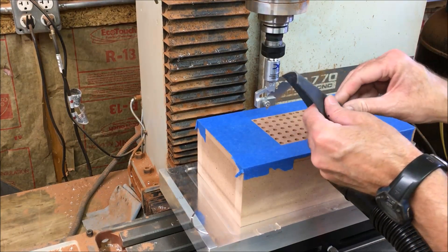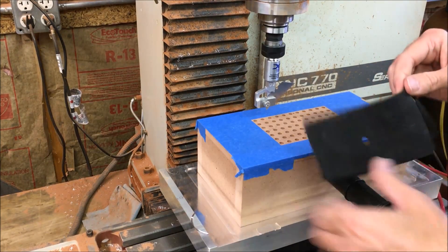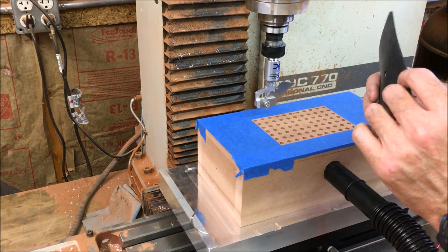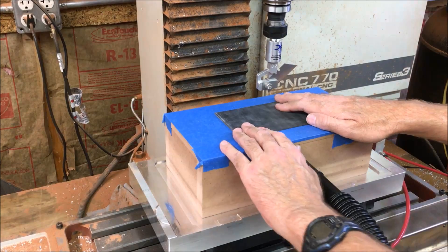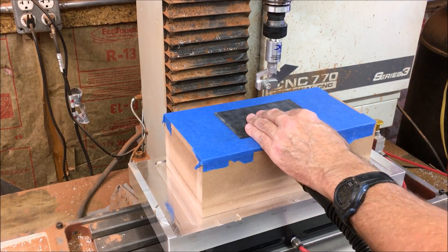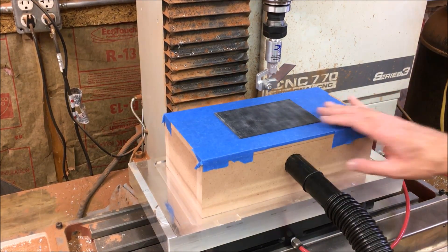The center always seems to be fine, but it still has those little things on there, and they seem to be fairly evenly spaced — I get the suspicion it has something to do with these holes right here. Multiple depth of cut didn't work, so what I did was lower my Z height so the blade would actually go 5 thou out into the wood. I couldn't actually do that in SheetCam like you can in Fusion 360, so I had to change it in the work offset in PathPilot.